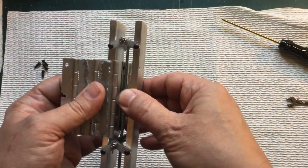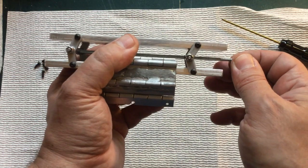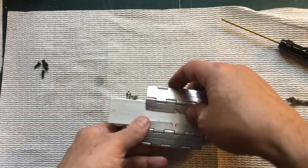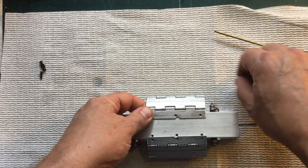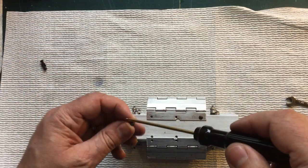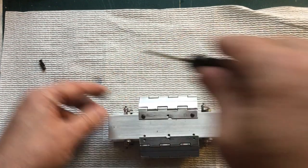So hopefully you can kind of see now how this is going to work. When you pull this rod this way — which is going to be driven by a solenoid — it lifts up that top tray. And when it gets pushed, that top tray drops down. These hinges are to hold everything parallel. There is some binding that I don't like, but I think I can work that out with some fine tuning and a little bit of shimming. I'm not going to Loctite these in just yet because I'm probably going to have to take it apart and reassemble it a few times until it all works nicely.